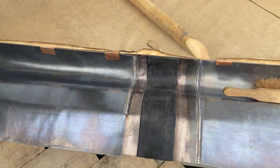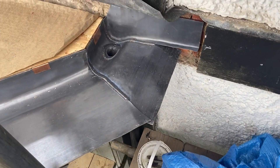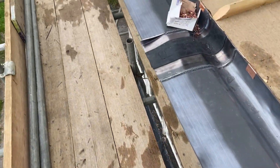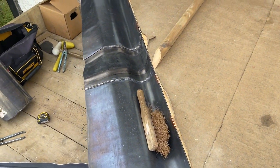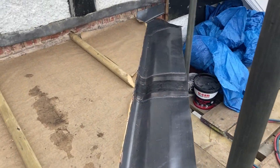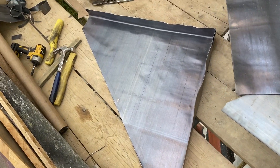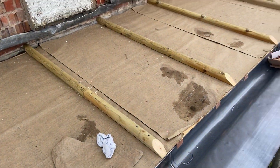Okay, so as you can see now, that gutter is all in place, all the way around. Got a little tiny outlet on the end there. Now what I was planning on doing was getting all the front down turned into the copper and doing a finished job, but I'm a bit concerned about how long this roof's going to be with a plastic sheet over, so what I've decided to do is leave the gutter like that and concentrate on getting these bays in — just get the undercloaks sorted out — just so I can get a little bit more lead on there to keep it a bit more in the dry.